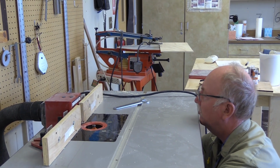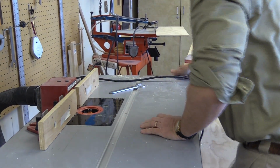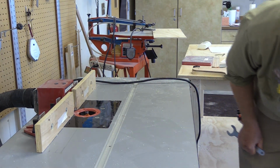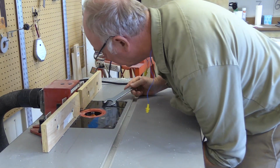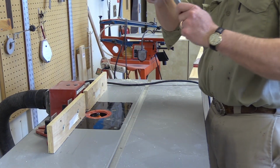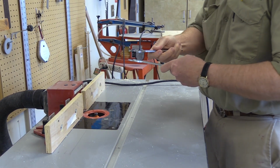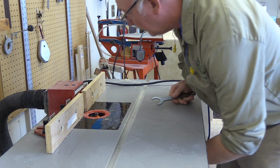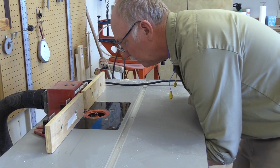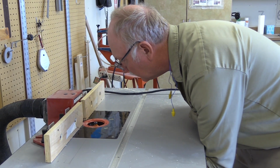Okay, there it is. I went way up and then I had to come back down again. If you don't do something every day, you kind of forget how to do stuff. You have to remember. Okay, that looks good. Remember the whole thing where, with tightening and loosening, if you're tightening, you want to have the wrench like this. If you loosen it, then you want to go like that. And then you can just use one hand, you won't knuckle bust. See, that's tightening. This is loosening.